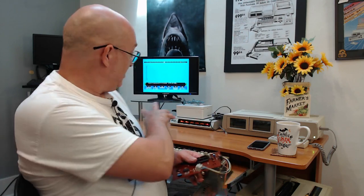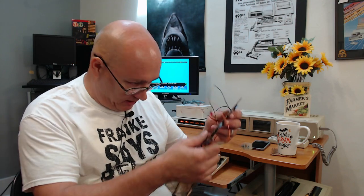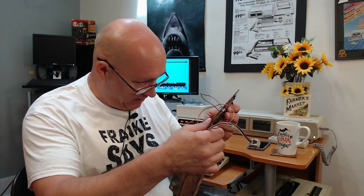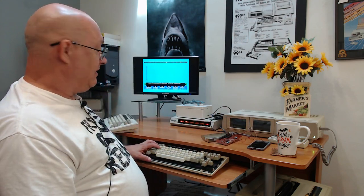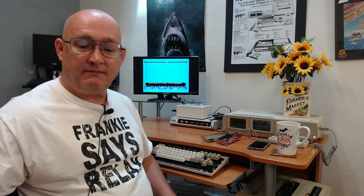So that's good that we know that, because now I'm gonna send this back to Mark, because this I can fix at any time in the future when I get a chance. I'll just write down in here something bad on board and I'll chase it down and I'll figure it out. It could be something as simple as a broken solder joint in the back, who knows? But the microprocessor works. So I'm going to switch back over to the bench. We're going to assemble it and we'll be done.